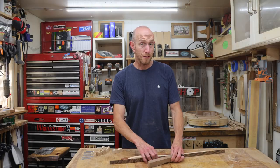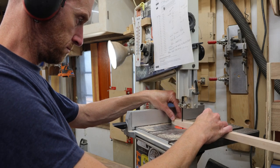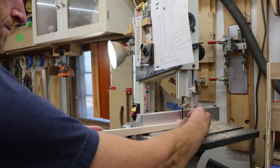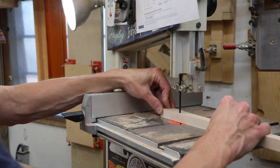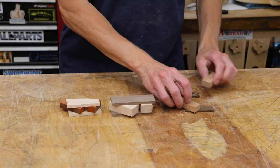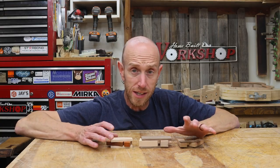I've been playing around with some ideas and gathered up some random scraps of different species of wood. All we need are two flat pieces for the sides and then a couple pieces that are the width of the blade — in my case, half inch. I'm going to take all of my scrap pieces to the bandsaw and rough out all the parts for these three planes. I'm not worried too much about dimensions at this point — just making sure there's plenty of extra material to remove when it comes time to shape these.